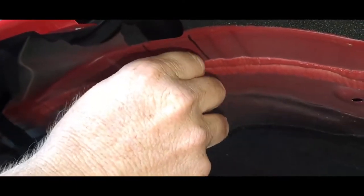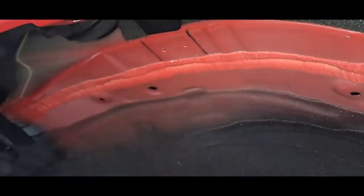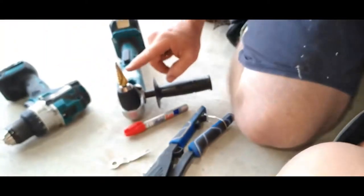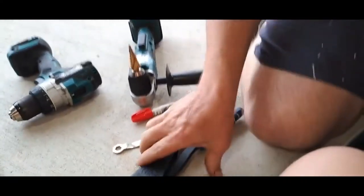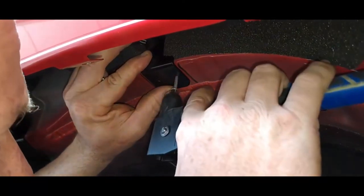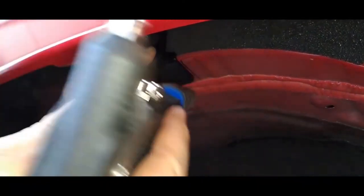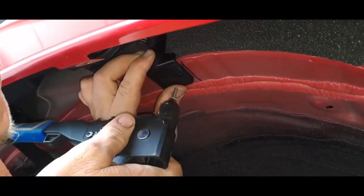You probably don't really have to worry too much about the paint protection here because it's got rivets going in it and you can't get up inside anyway. Be careful — I'd use those bits. It says 5mm but that's a 4mm drill bit; it still fits. You don't want a drill bit where the hole's going wrong.